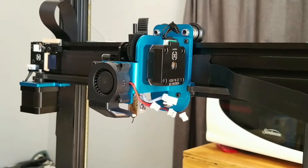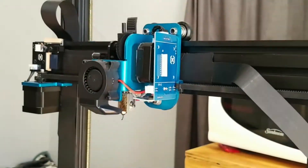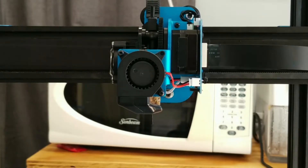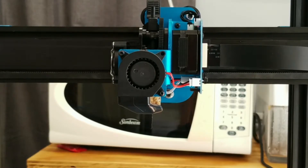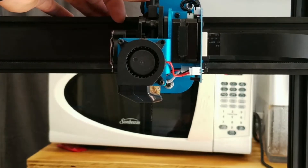For the last part, all I'm doing is putting the board back on. First I connect all the cables — it makes it a little bit easier — and then I put the screws back in, making sure to put that back plate behind it. Before I get everything cased back up, I want to test to make sure the cabling works and that this is the problem, so I'm going to try to extrude or change the filament. And it runs like normal — that is normal operation.